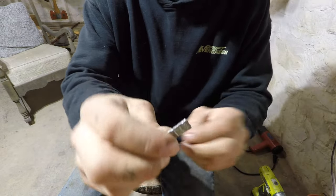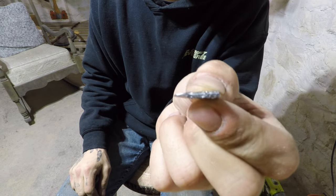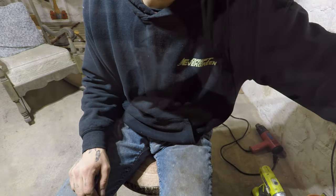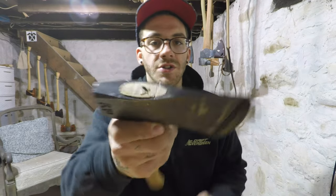If you wanted to save this wedge and reuse it, you can — it's not compromised, it'll still work just fine. Me personally, I will not be putting a step wedge back in this. The wooden wedge is still in there, so we're not going to be able to tap this handle out because the wooden wedge is still somewhat doing its job. The head is loose but not loose enough to just fly off.